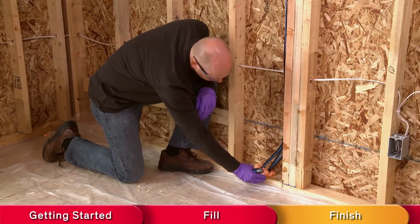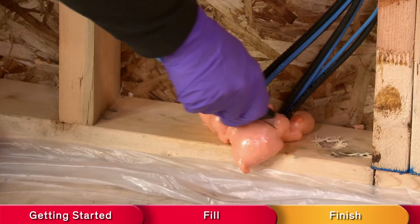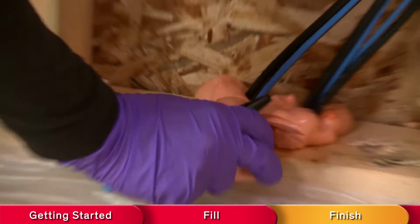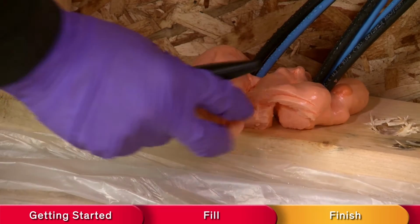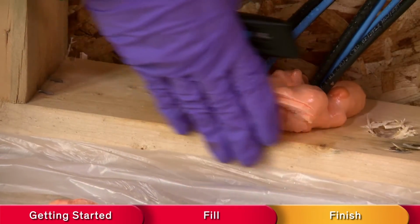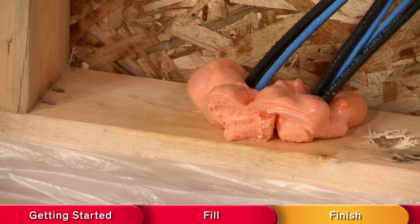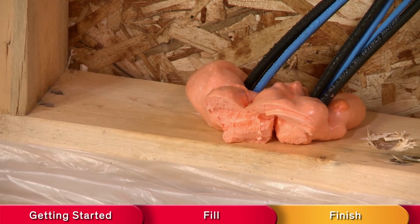After 1 hour, inspect the gap or crack for any areas where the foam has expanded beyond the leading edge of the opening. In the event of over-foaming, wait until the foam is fully cured, approximately 8 hours, and then sand down or cut the excess foam. Do not try to wipe off the excess foam with an acetone-soaked towel or cloth before it's cured, because acetone will adversely affect the proper curing of the foam.